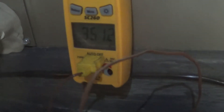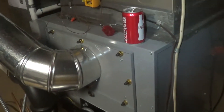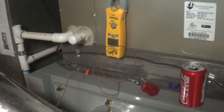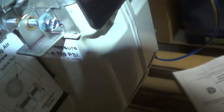Another thing to check is your flue gas temperature. We're running 350°F, and you don't want to run your flue gas cold or you can start getting condensate and rust related to condensate. 400 would be ideal; 350 is pretty close. I don't want to pinch back the air — that's how I'd raise that temperature — because I'm already set kind of low, and that's the factory setting on the air mixture.